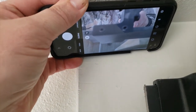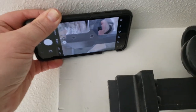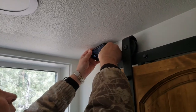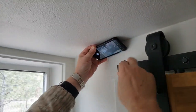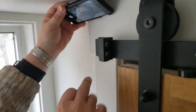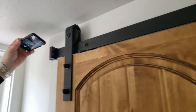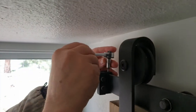Those are the screws. Got to find me my tips. A tip that'll fit that screw. So this is a number 3 metric, I guess. Oh, it fits like a glove. So I'll loosen this thing, slide it completely off, then I'll be able to slide the door far enough over to clear the bottom guide and hopefully lift it off the track. Where's the other screw?